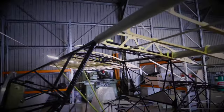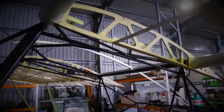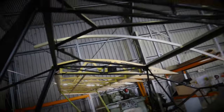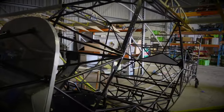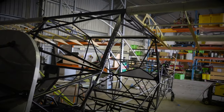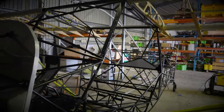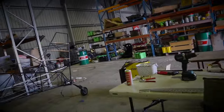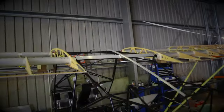It is hard doing this with one hand with a camera in the other, but I'm sure you know what I'm getting at. So butt rib installed — then you can make sure this bar here has the right angle in it, because you have to bend that yourself. It's not very hard, it's just a matter of getting it right. Then you can put the turtle deck and the roof on. If everything lines up, make a start by Clicoing it — don't rivet it straight away. Clico it all in place, and if it all fits correctly and you're happy with the overlap, then pop some rivets.